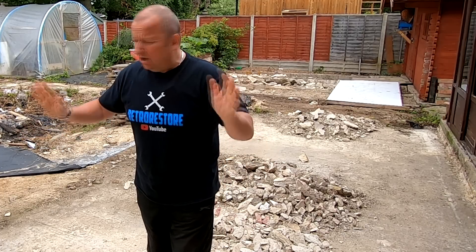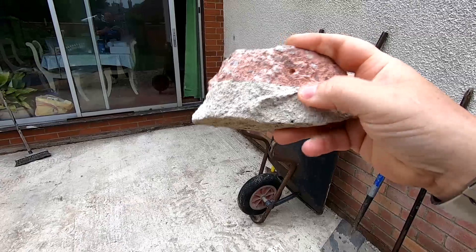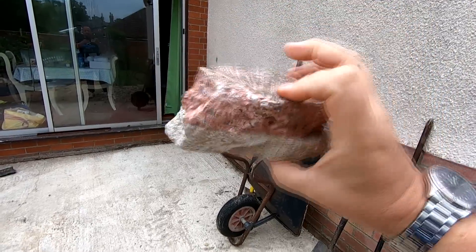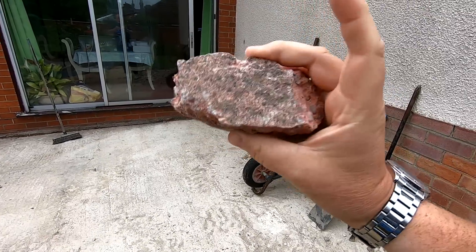If you've seen my Butler's Empire videos, you would have seen the garden and getting the patio up. So this is where we had the original brick pathway — the patio with paving slabs. Underneath, someone has actually poured a concrete slab, so we can basically lay our patio directly on top of that. This was the sort of thickness of the cement that was underneath, which we chipped up. What happened was the mortar base the slabs were sitting on actually came up with the slabs.